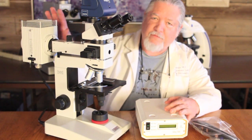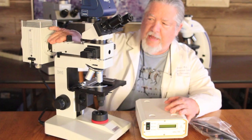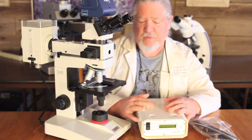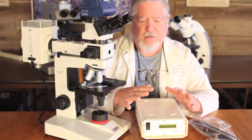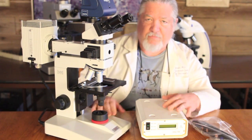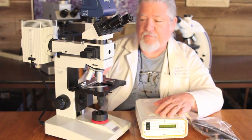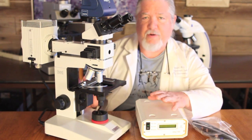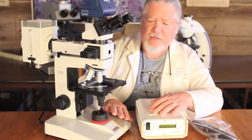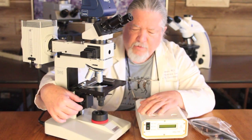We have turned off the illuminator as you saw previously, and now the lamp housing is nice and cool to the touch, as is the vertical illuminator. Now we can begin to remove things from the microscope. First, we need to unplug both the transformer for the vertical illuminator and the transformer for the microscope. Let me give an overview: this is the Helmut Hund from Wetzlar, Germany H600 laboratory microscope. It's a standard upright light microscope with an illuminator in the base — 6-volt 20-watt — and a condensing system on a condenser rack that I can rack up and down.